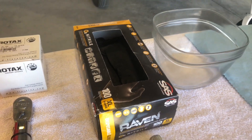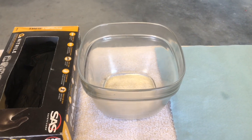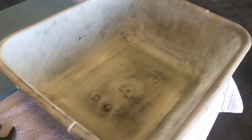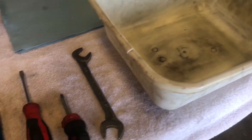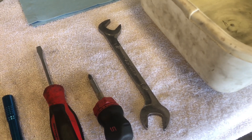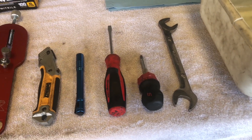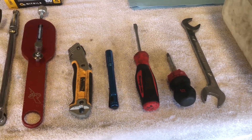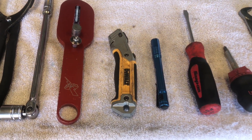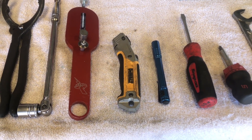Gloves for safety, especially if there's lead in the oil. You'll need a clean container for cleaning the filter element once it's removed from the old oil filter, and a container to drain your oil into. A 7/8 wrench — the 3/8 drive versions are very helpful for getting some of the tank fittings that are a little hard to reach on some engines. A Phillips screwdriver, a flathead screwdriver, a flashlight, and a razor knife. Having a sharp razor knife is really the key to getting that element out of the filter intact.